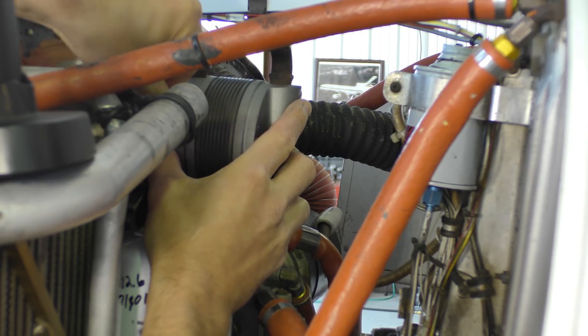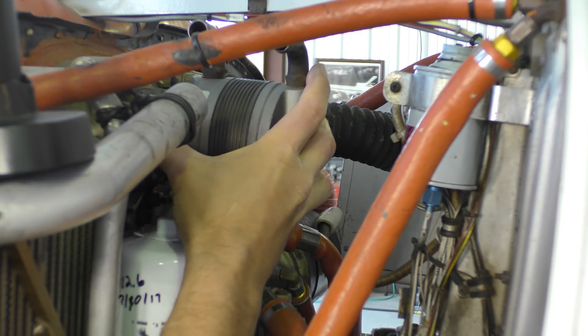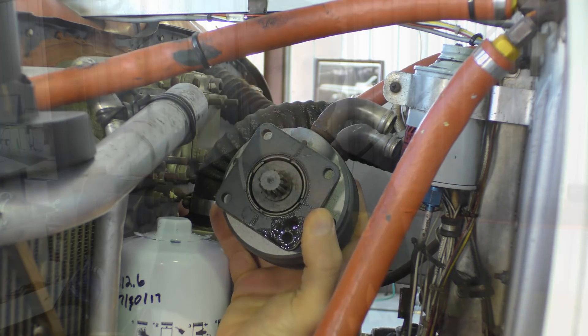When the pump is fully against its pad there isn't enough space to remove the washers. You have to loosen each one a little bit and begin the removal process incrementally, then gently pull the pump back and remove it.